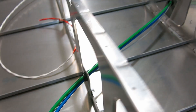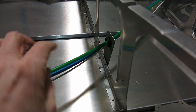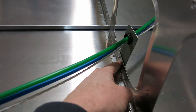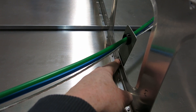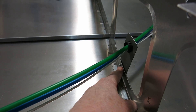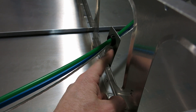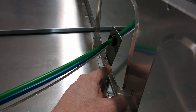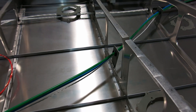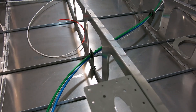Put the deeper ones in and those are working good. So this is our solution to not using safety wire through the rib — we added an additional hole in the rib there, got that riveted in with a dash-42 rivet. This sheet aluminum is 40 thousandths; the ribs are 25 thousandths, so that fits a dash-42 rivet in there. That's what we've got going on with that.